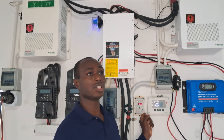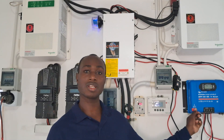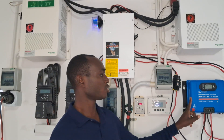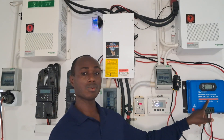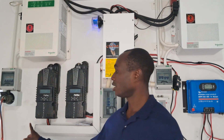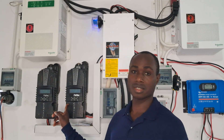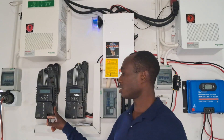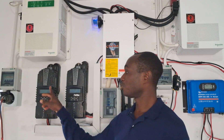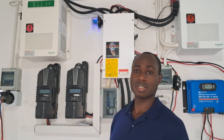I'm going to put a bit of load on it, then turn back on the charging source. I have 6000 watts of solar panels now, and I've upgraded one of the charge controllers to a Victron 150/100. In a previous video I had a C-series charge controller running with two Midnight Classic 150s — those are still there. I've done some modifications on them; I drilled some holes into them because they keep getting hot, and I'll do another video on that.